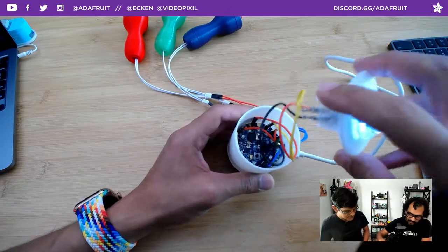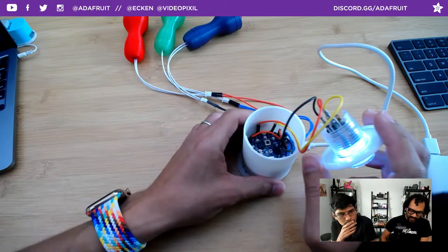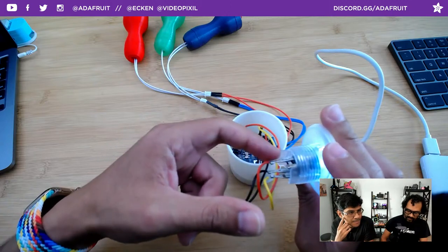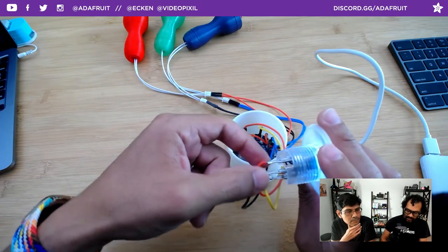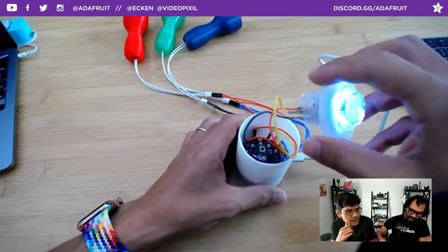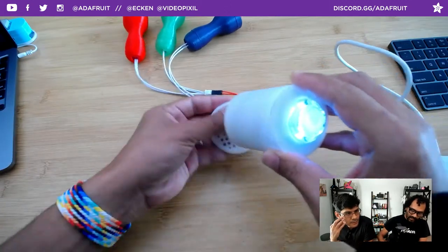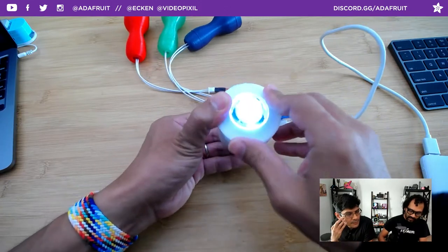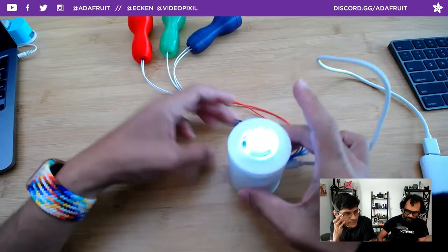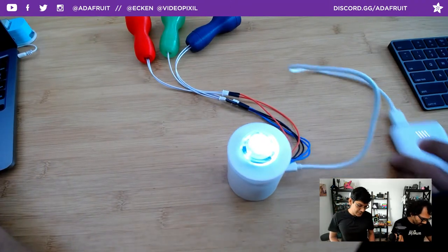Super handy. Yeah. And of course, all the wires. We're using the silicone coated jumper cables for this. And I'll go into more detail. I did have to make some custom quick connects. I took the little connector part the way it comes and then soldered it onto these jumper cables, just to make it a lot easier. It's a good size so it could actually fit in there. So you can screw it in there like that. Yeah. And it'll have room without having too many wires all over the place. Oh, I have to align all of these tabs. Yeah. One of the reasons why you want tabs as opposed to a screw is because your wires and cables will twist. So having a snap is a little bit better.